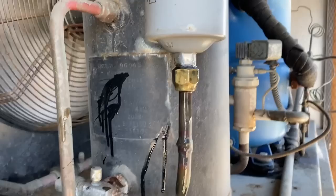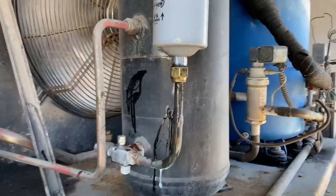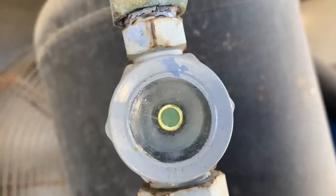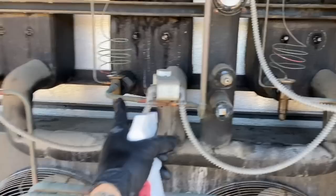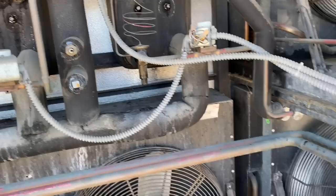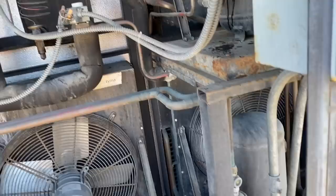Both sight glasses are flashing — that's not good. Got her soaked up good with soap and we'll let her sit. You can see the compressors are no longer flooding back — we've got a clear sight glass now. She just needed to run and adjust. This one cleared up also — clearing up and flashing, they're doing their job. The frost pattern on the valve looks better now that we got a load. I don't think we're low on charge — it just needed to run for a bit and settle in.